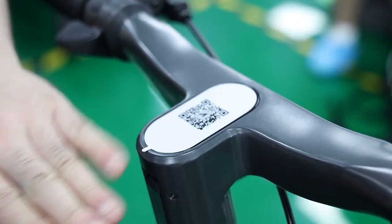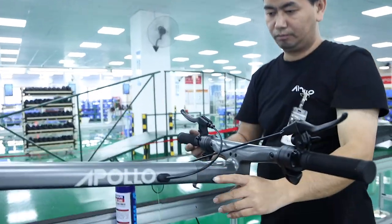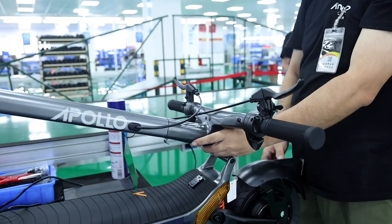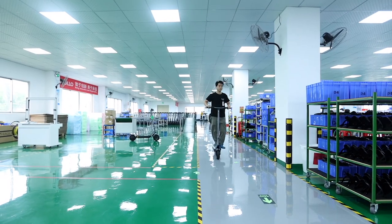The final finishing touches are completed, including a thorough cleaning of the scooter before a final visual and basic functional QC of every completed unit. This final quality control check consists of turning each scooter on, checking the lights and motors, verifying the brakes and tire pressure, folding mechanism, and the Bluetooth compatibility. Then the scooter is taken for a quick 10-meter ride to ensure it rolls smoothly and brakes properly.